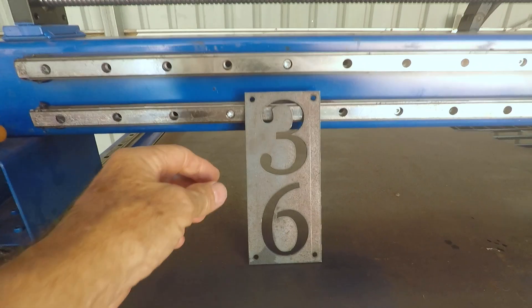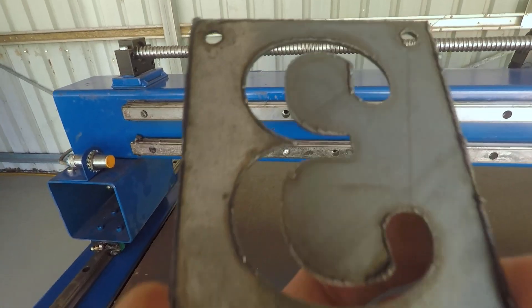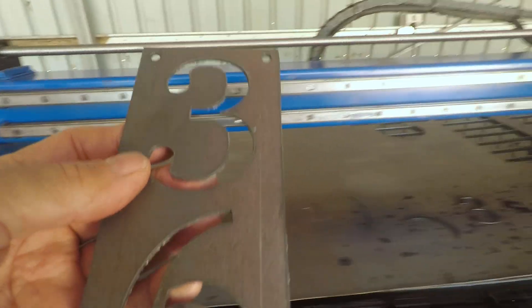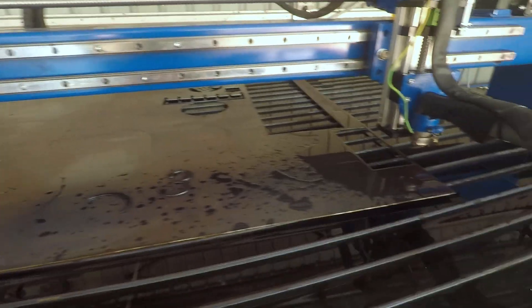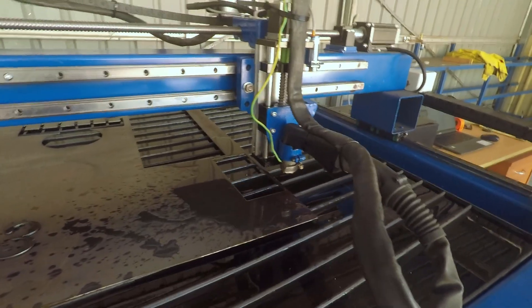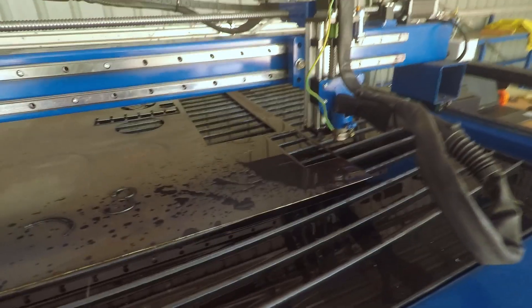Here is that piece I've just taken out of the cutter. Looking at the back there's still some build-up, but that's typical of the cut speed and amps I've got — and it cleans up really easily with a wire brush. I'm pretty pleased with the table. Also impressed that the water catches so much of the residue, smoke and fumes you've seen in previous videos. Definitely a winner in terms of needing the water table for fumes — you certainly don't want to be breathing them. I've also noticed the dross on the back just chips off — I think the water is cooling and quenching it quicker so it doesn't have time to ball up as molten slag and stick to the metal. That's another great side benefit.